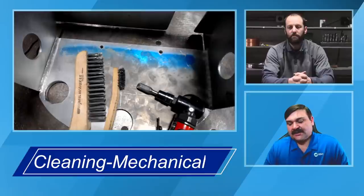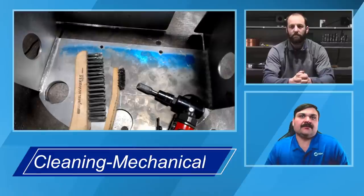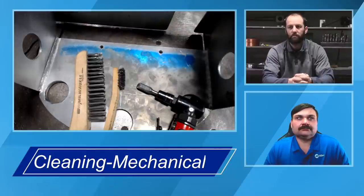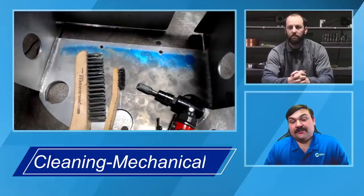Perfect. James, I know we've had a couple of questions coming in on mechanical cleaning before we move on here. Yeah, we've got a couple of them. Do we need to brush in only one direction? I would say the direction isn't quite as much the concern as it is the force. Like Andrew said, you want to make sure you're using enough pressure that you're actually getting material off the surface.